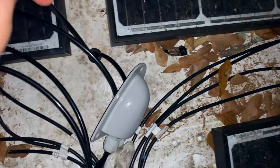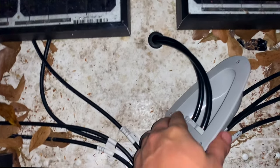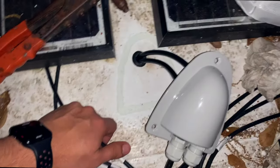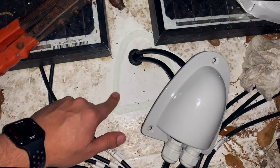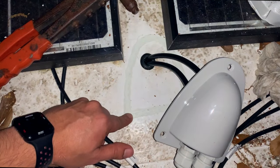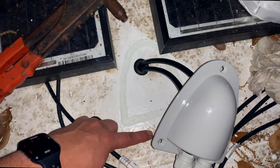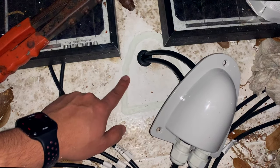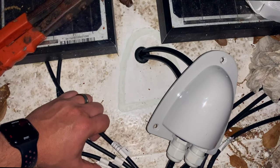Think positive, think positive! Alright — both wires through the grommet and into the actual bus. Now I have to mount this gland down here. Just like I said before, if you have a tropical or silicone coating on your bus make sure you scrape that off because the butyl tape won't stick well. I went ahead and did that — now I'll put the butyl tape down, place the gland on top, drill the holes, put rivets in, and hopefully be done with it.